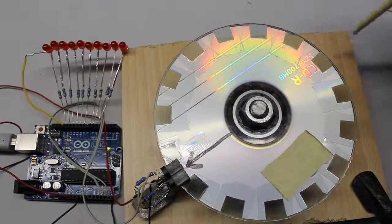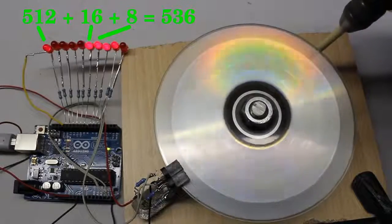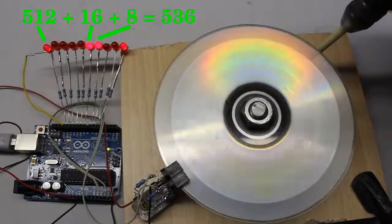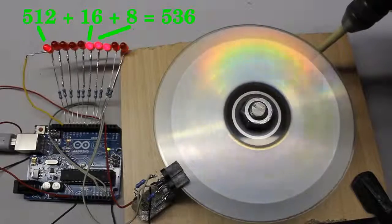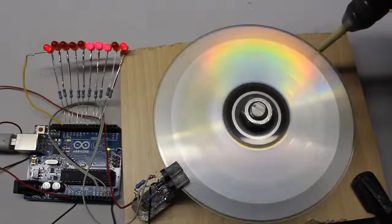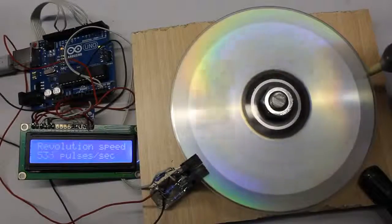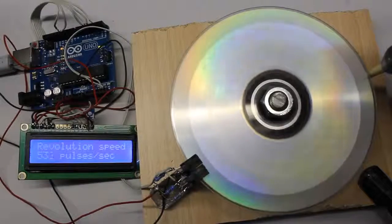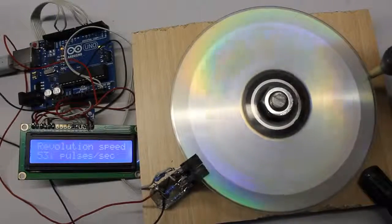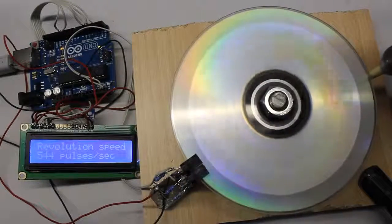The clock cycles of the microcontroller can be used for timing purposes, and pulses per time interval indicate the current speed of the sensor disk, strictly speaking the angular velocity. That velocity can be displayed using the LEDs or the liquid crystal display. When refreshing the information just once per second, the number of skipped pulses is negligible, thus the displayed value is congruent to that of the LEDs.